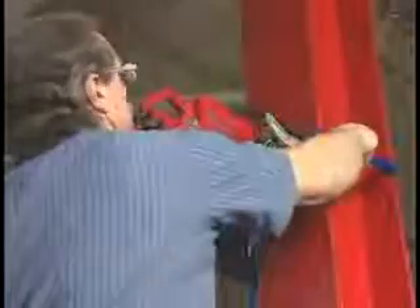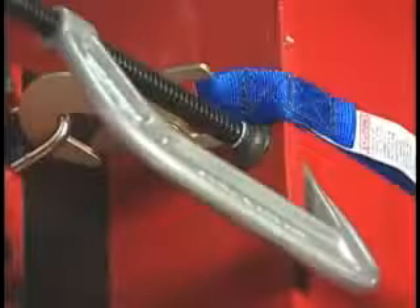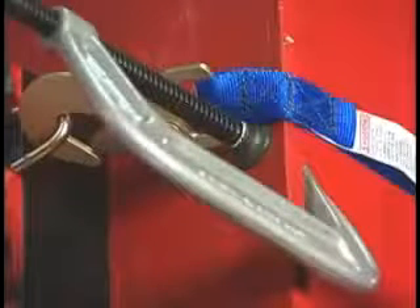Review and follow the safety rules found in your operator's manual. In addition, there are some rules specific to this tool. Power loss demagnetizes the base — for this reason, always use the safety strap for overhead or vertical work.